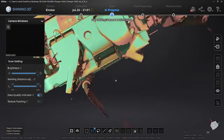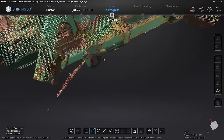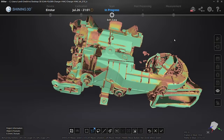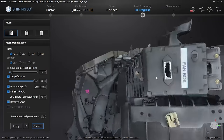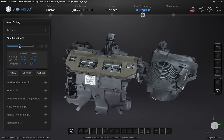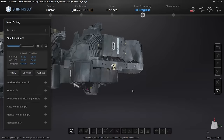Now that I've got this thing pretty much fully 3D scanned, I need to go in and clean it up a little bit. You can see the legs of the sawhorse — we definitely don't need that, it's just in the way. It's not a whole lot of work to go in, clean it up, delete whatever floating objects are there. Sometimes this thing just picks up random stuff. But once it's edited, you get to see the final result — and this thing is crazy. Just look at the detail: it picks up bolts, all the mounting, you can read the labels, even the part number. The amount of detail this thing picked up is insane. But for what I'm doing, I really don't need that, so I'm going to go through, simplify it, drop it down to about 50%. This thing currently has like 900,000 triangles in it, so drop it down to about 470. It makes it a lot easier dropping it into Fusion 360 — it struggles otherwise.